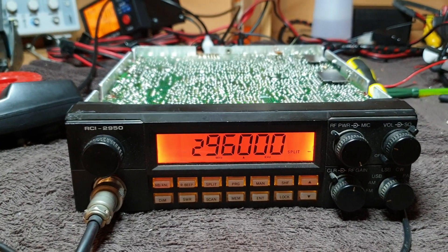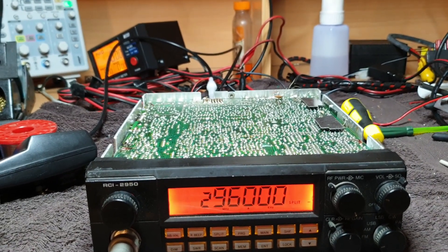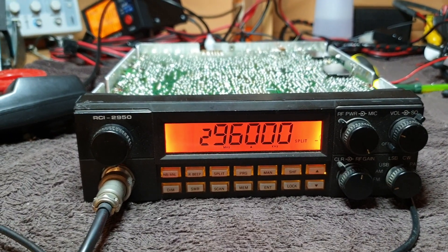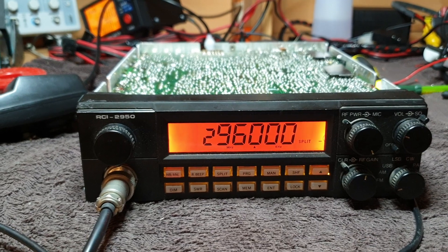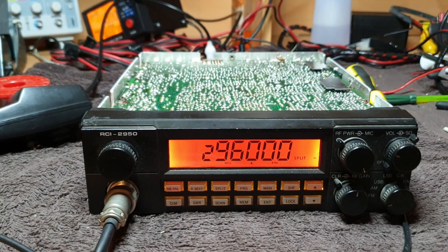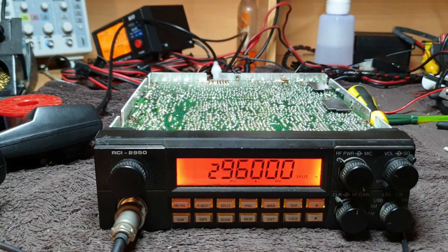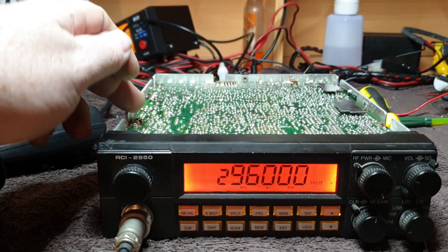I'll tell you who taught me to chase voltages - I'd been out of the game and hadn't fixed a thing for a very long time. VK7RX came and stayed here for Christmas and on Christmas night he took me out to the other workshop and said, 'Let's go through some basics - what do you do when you change a tire on a car?' Check voltages, check the obvious things, stop guessing the fault. So Bob's got me going back to basics - checking lines, checking volts. It's not always the glorious PLL or VCO fault, but it saves you a lot of time when you find out it's just a missing 8-volt line.